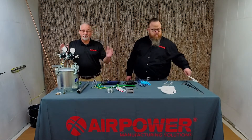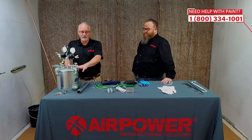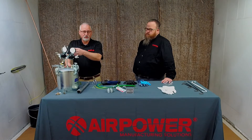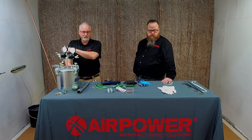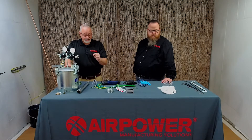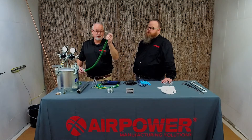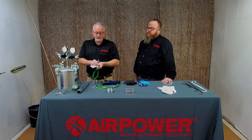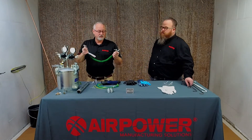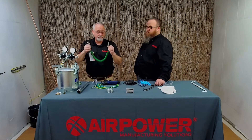We've got your parts grounded, your hooks grounded, your conveyor grounded, your supply grounded. If it's powder, you're grounding the controller to the ground. We want to keep that separate. Do not take a wire connected to your powder controller and attach the other end to your part — we do not want to send that voltage back into the chassis of the electronics in that controller. Don't do that. Make it a separate ground.